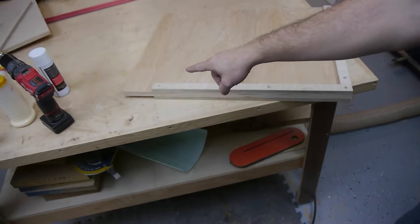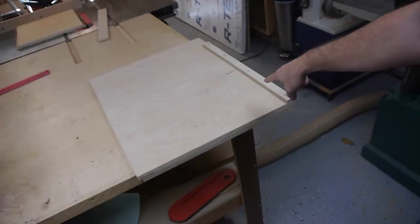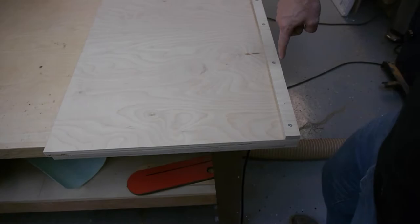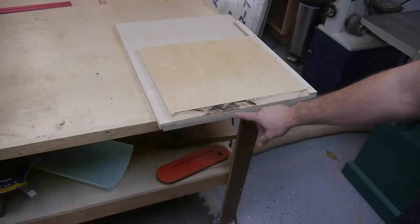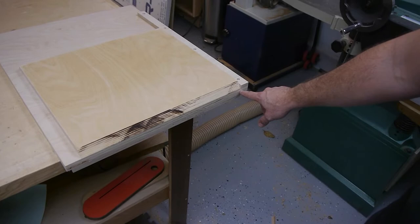All right, so I came over and I made this jig. I've got a couple of tracks here set up so that I can safely clamp this to the workbench. So my panel will come in and ride against this square edge and this square edge. The bearing on my chamfer bit can run against this square edge and leave a 45 degree angle on this edge that'll stop square up against this here. So we're gonna test that out, see if it works. I'll let you know.